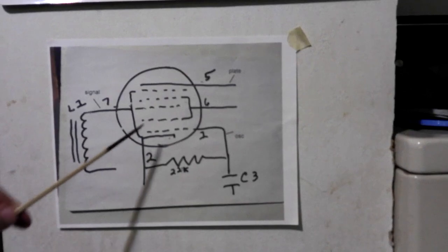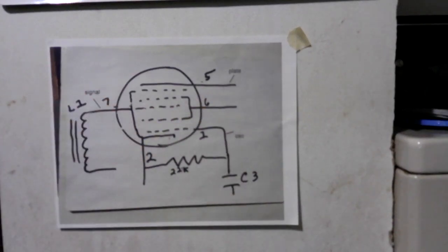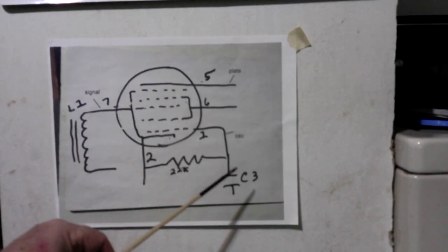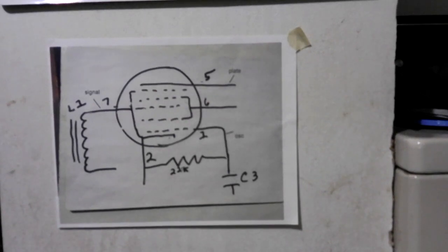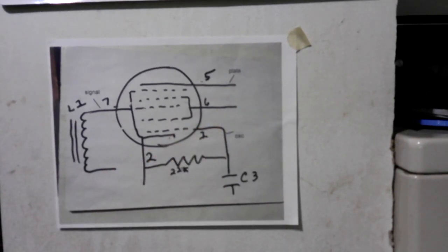It goes in through our tube. We have the four, but it uses the one that is the lowest, the one where the signal is subtracted from the oscillator, and that's what we use. So, like I said, all four of these are going on, but that first transformer is set up to only take in the IF frequency that we want, which is that one, and it'd be 455 in this case.